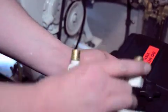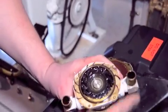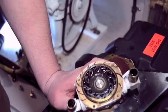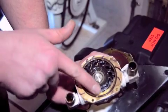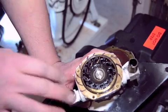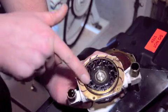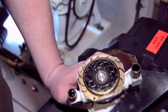I'm going to dump this water out. In this instance all of our blades are here, which is very good. We don't want to have to chase blades down, because that's more labor and it can take a long time to find all these little blades within the cooling system of this engine. Also take notice of our cam — we've got a cam surface here, and you can see where the blades are bending, and of course when this is whipping around it causes a suction effect and pumps water through the engine.